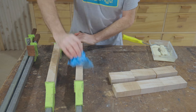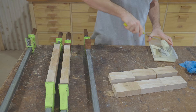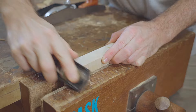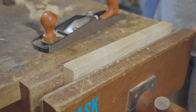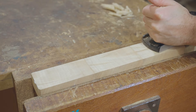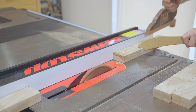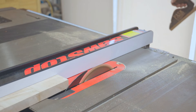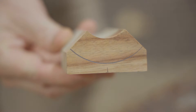I'm being careful to try and line these pieces up well. I won't be putting them through the thicknesser because of the direction of the grain. They came out pretty well, but I still cleaned up one face and one edge with the hand plane. I then trimmed up the opposite edge on the table saw. I made this block just as a test and now I can use that to set the fence on the table saw and the router when I come to make the final corner pieces.